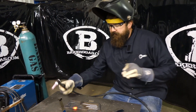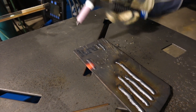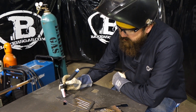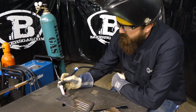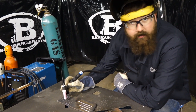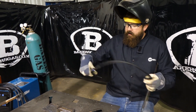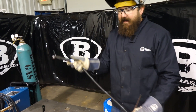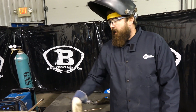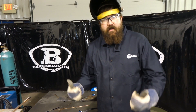As you can see there, it turned out pretty decent, and that's on quarter inch material — not too bad. With lift arc, sometimes if you're not familiar with it and you're used to high frequency, you just touch and it'll feel like it's stuck. Don't rip, don't pull — just gently lift up. If it gives you a little bit of resistance, you've got to pull up just a little bit harder, and then that'll initiate the arc while the foot pedal is depressed. Just remember you've got to keep it down. So there you go — there's the setup on the TIG kit for the Multimatic 215. Thanks for watching, stay tuned for more. We're going to have another video on this 215 with some additional stuff. Leave your comments below and I'll be sure to answer your questions. Thanks again for watching.